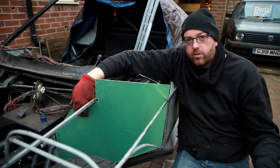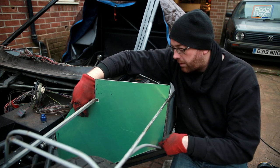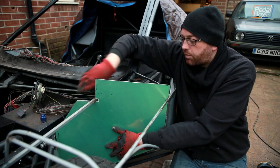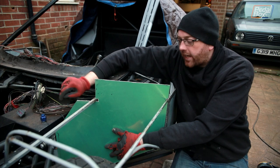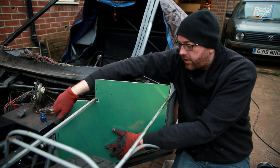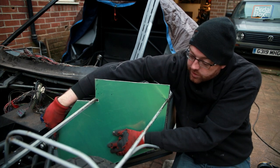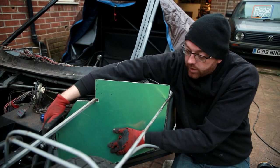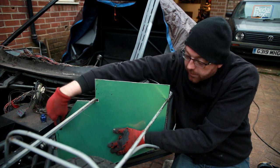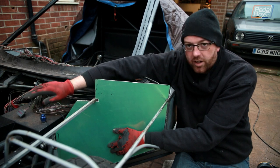With this basically fit, I'm going to draw it out onto the other piece of aluminium, then start attaching this onto the chassis — drilling the holes into the brackets on the back, fitting the rivnuts, and fine tuning the fit in the inner corner. One mistake I made is not leaving quite enough on this end for a return flap to come around and attach onto this panel. It's not a show-stopper, but I'm going to have to weld on another piece for it to attach to.